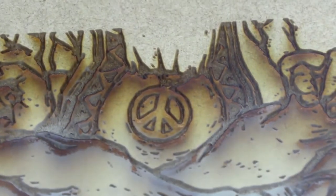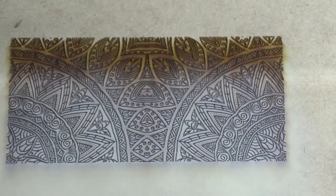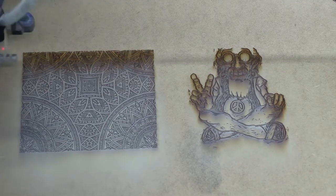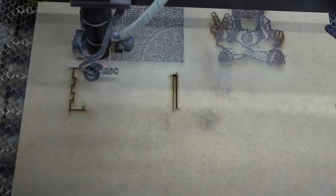The settings I'm going to use today on this 3mm wood are 60% power at 18% speed for cutting. For engraving, I'm going to go up to 45% power to get a nice deep engraving, and I've found the best accuracy without burning the wood too much is a speed of 330. With a smaller power supply and smaller tube, you can get even more accuracy and more intricate designs engraved.